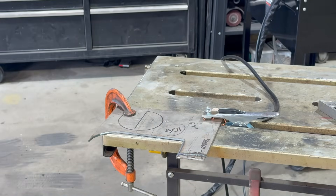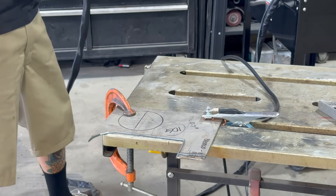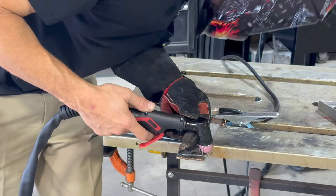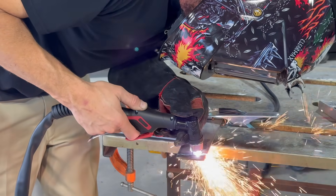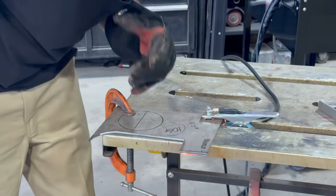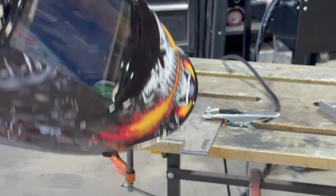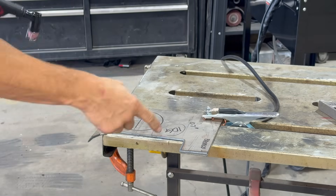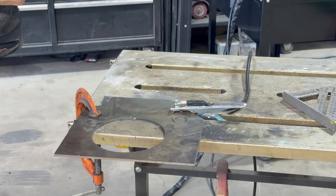Okay, so it did push back a little. I think now's the point where you need to increase the amperage — we've been running on 35 amps, which is nothing. Let's add a little more — running at 40 amps now. Okay, back to cutting. Minimal dross, that could be air pressure. Nothing that wouldn't knock right off if you're building something.